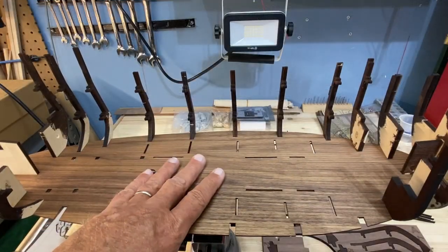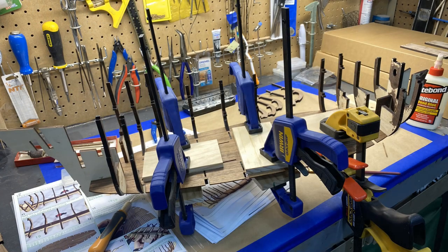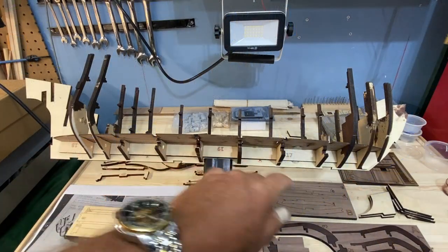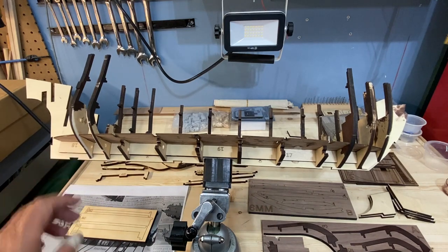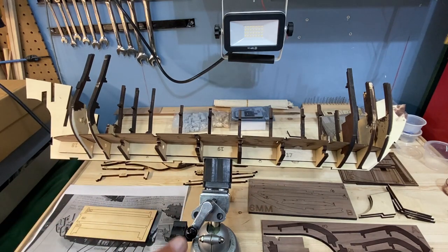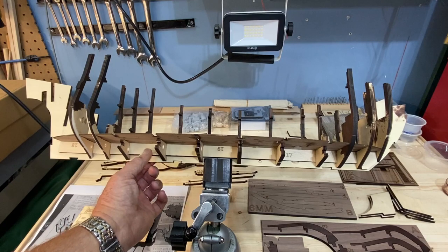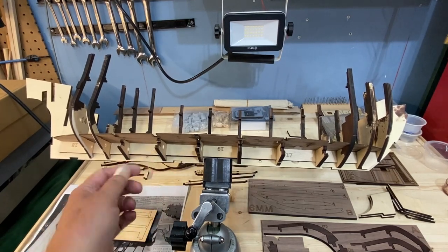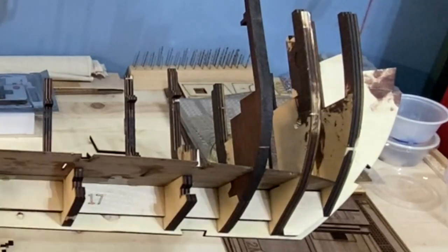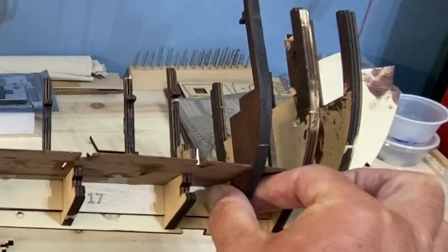Helpful hint: I've got the lowest deck in place, glued, sat overnight, clamped down as tight as I could get it. You can clearly see parts 17, 19, and 18 — the sequence isn't in order but that's how they go, forming that bottom brace that makes the centerpiece thicker and stronger. Now I'm ready to put in the ribs on this side. I have one in position and there'll be some sandwich pieces that go in here to hold it in place.